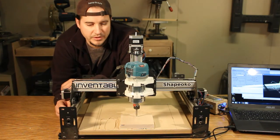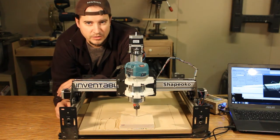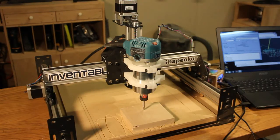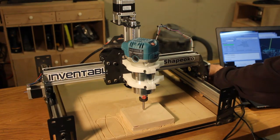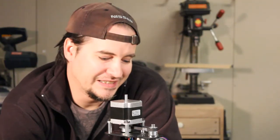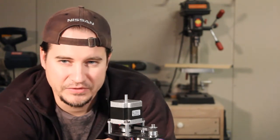I chose a program that's been featured in one of my other videos — it's just a simple text engraving. It has a lot of up and down Z-axis movement, which I figured would be pretty good to test the new Z-axis upgrades. In that last clip you can see major screw-ups — the Z was pushing into the board. Apparently some of my wiring is wrong, but the Z is definitely moving in the wrong direction.